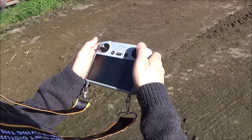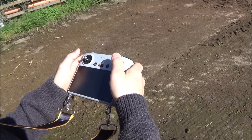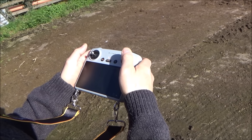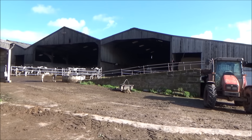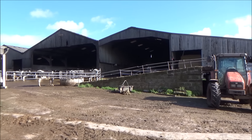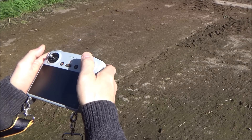It's a very tight space — there's not much gutter to see. It could be just the joint that's failed; there certainly doesn't seem to be a blockage. I think the problem area is literally between the second and third roof light from the far end. So if you start at the far end, it's between the second and third roof light — that's where we need to look closely.